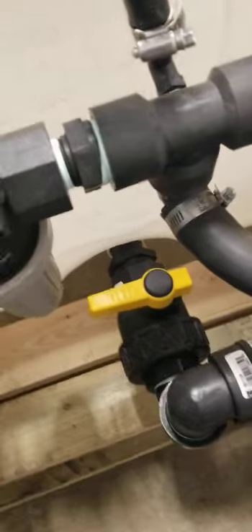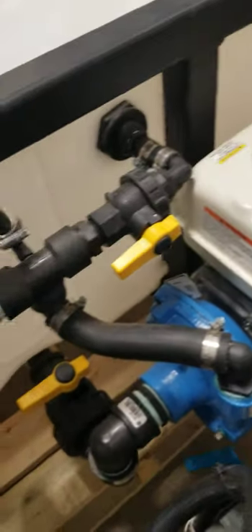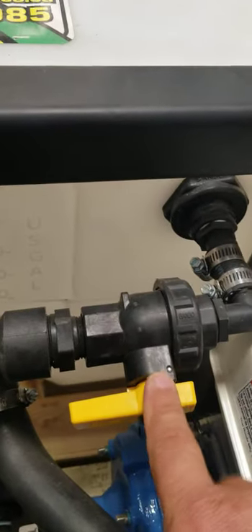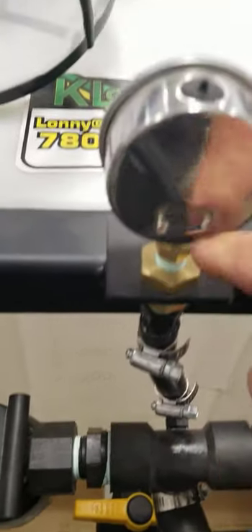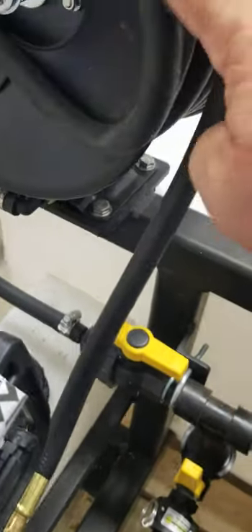The suction line comes in there. You can shut the tank off to remove the pump or make repairs. It comes out of the pump up to the agitation pressure control, then up to your pressure tank so you can see from the front cab — filter, shutoff lines to the booms, as well as the shutoff that goes to the hose reel.